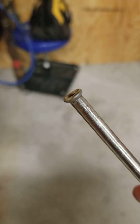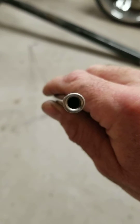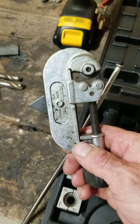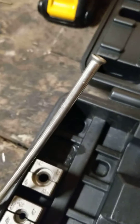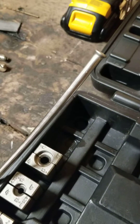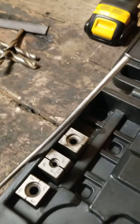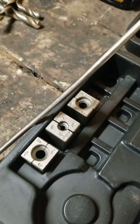Every time. I don't think I've ever had a bad one — I've done a whole vehicle with this. I've had it for about a month and every time this stuff comes out perfectly concentric. I don't know what people are talking about when they cut this tubing, but I'm using this cutter. A lot of people say it work hardens the material, but I've had no problems, and you see the results here — this is stainless. This is probably the only video on YouTube you'll see of people flaring stainless. I've done three-eighths; this kit does three-eighths, five-sixteenths, three-sixteenths, and quarter. You can see the little dies right there. Great tool — about 200 bucks from Summit. Give me a thumbs up.